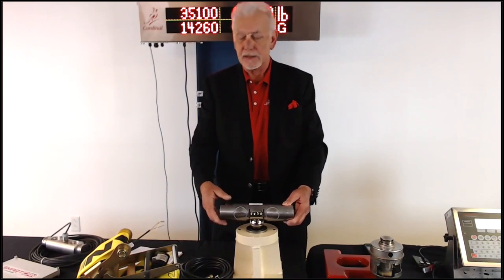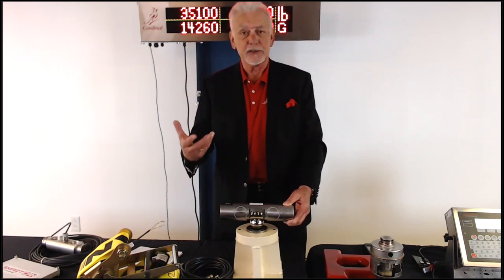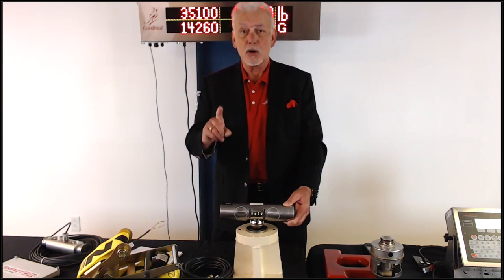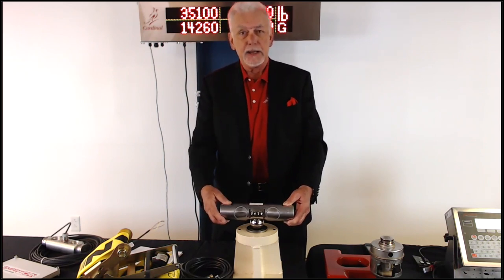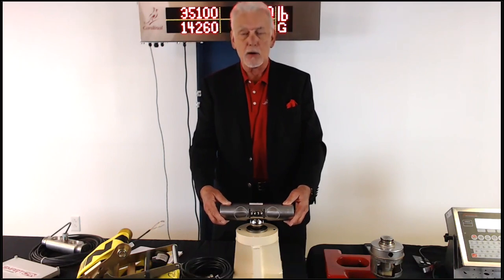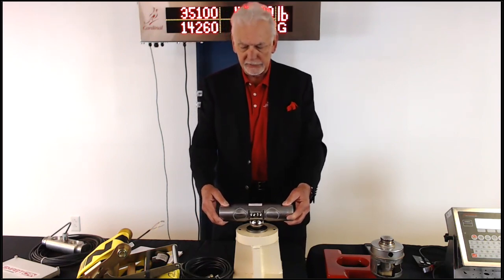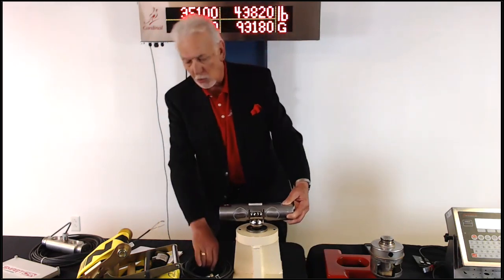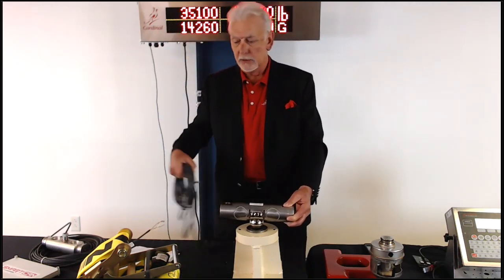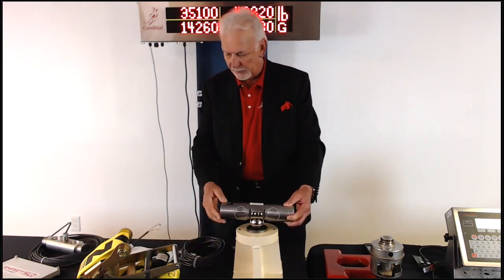Secondly, when we had the double-ended shear beam analog load cell, we had the junction box in the scale, which created power requirements to the scale. Anytime you're putting a portable truck scale in a remote area, in a quarry, in a gravel pit, power is always a problem. So we took power away from the scale. When I install an armor truck scale, all I'm required to install is the truck scale and the home run cable from the number one load cell to the reliable 225 indicator. That's a powerful, powerful statement.